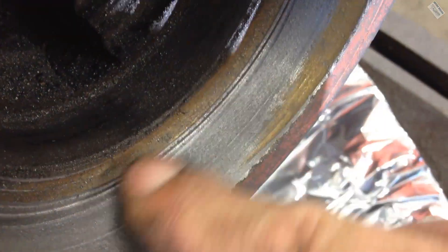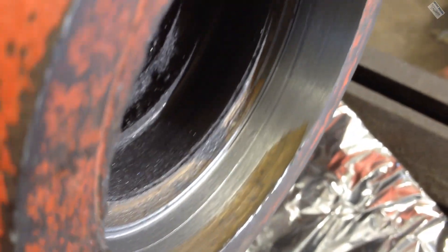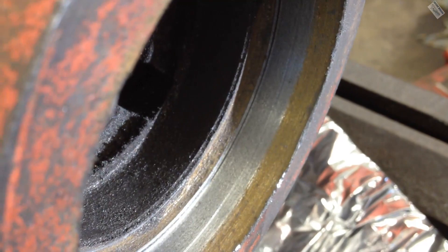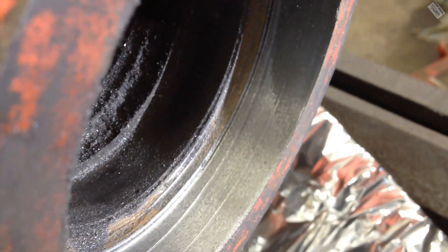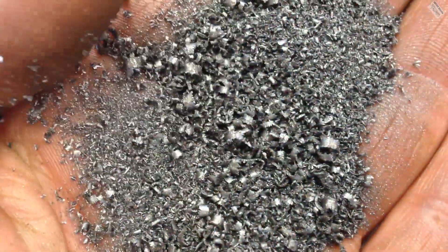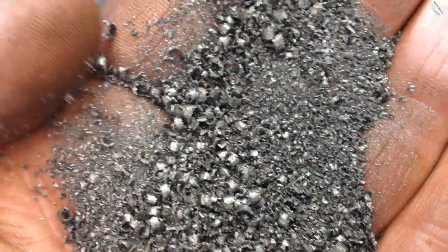Otherwise I can't complain about that at all. After that pass, there's not a lot that hasn't turned out. There's just a little groove starting right there, and it's more than three quarters of the way around that isn't touching — and it's not very deep. Sweet — one more pass. I'm almost getting some curly chip cuts where it's digging into the high spots, and just skimming elsewhere, turning to powder. Definitely some curly chips — I'm okay with that.